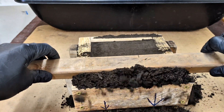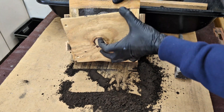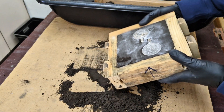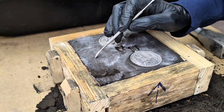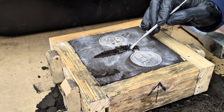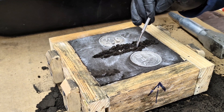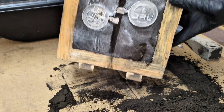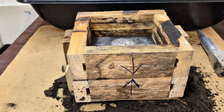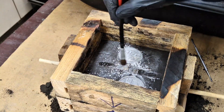Once compacted all the way to the top, level off the top by scraping off any of the extra sand and flip the casting flask over so we can then work on the other half of this flask. I'm now carving in a runner — this is where the molten metal is going to flow down through the center of both patterns. After I'm finished filling in the top half of the flask, I will then have to scrape away the runner from the top, which will leave me with that empty cavity that I need.